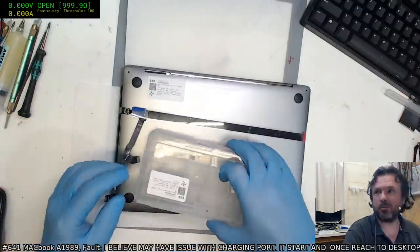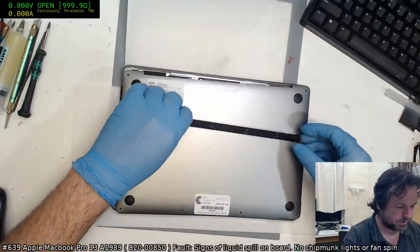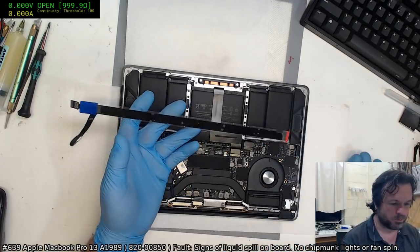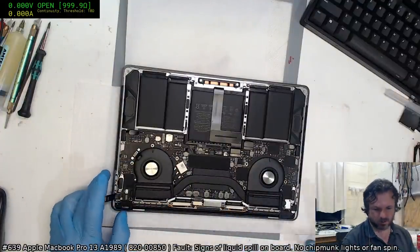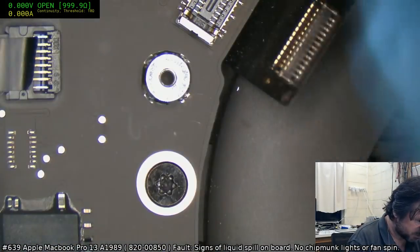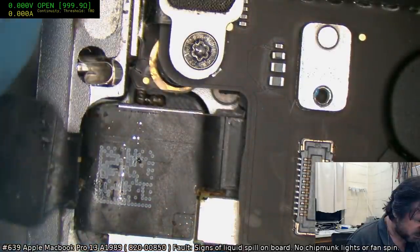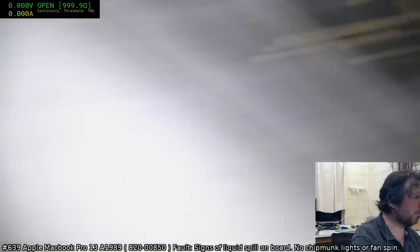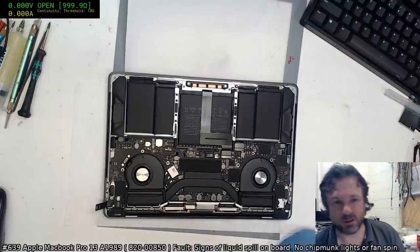So we have to bring it back. Thank goodness for the low resolution. Okay, so I got a new touch bar for it, plugged it in, it doesn't come up. Which, I'm not exactly sure. I mean, there's damage here, you can see the damage. But because I plugged in a separate unit, it should have bypassed that, but it didn't. So whatever liquid damage happened on those flexes has subsequently caused it to destroy the electronics on the board by the looks of it.